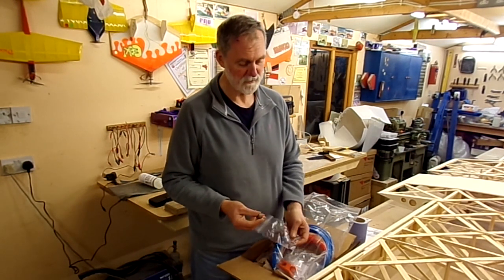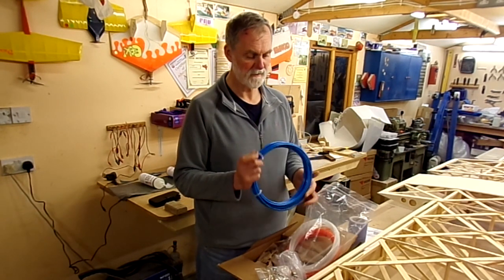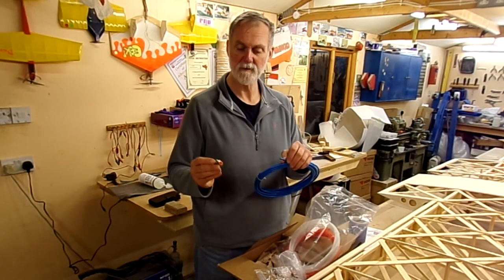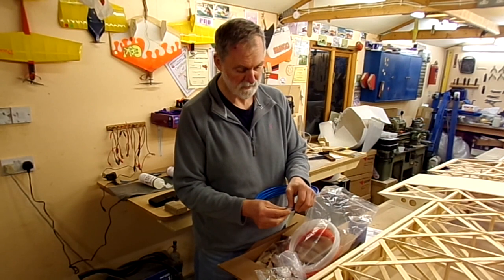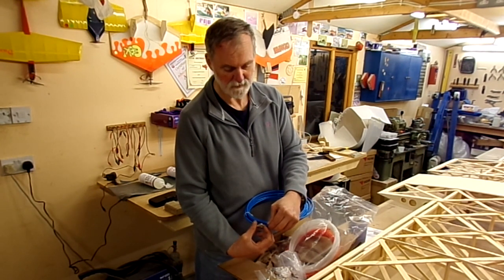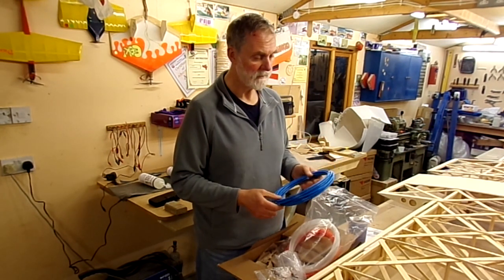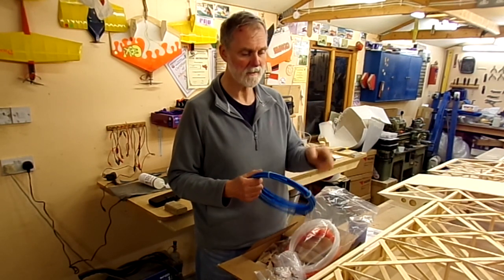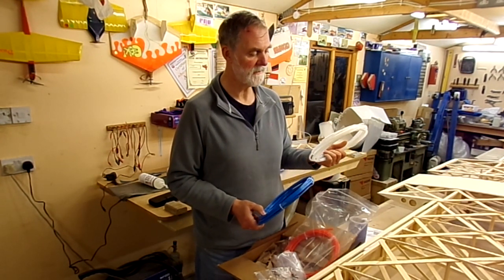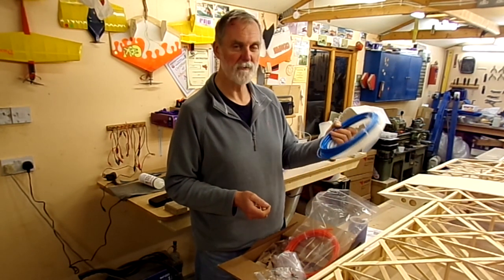I like this type of connector. I've used these on HGV lorries and various other bits and pieces in the past. This sort of connector — you cut the end of the pipe with a pipe cutter nice and square, then these just push in. They make a nice seal connector, won't pull apart very easily, then you can just push the ring each side and release. It'll also do that onto soft aluminium tubing, which is what I'm going to use for the pitot and static heads. The tube comes in different colours, which I thought was a great idea — I can have one colour for pitot, one colour for static, and as I route things around I won't get them mixed up.